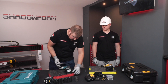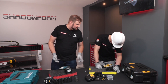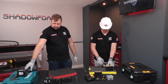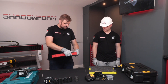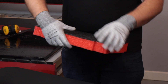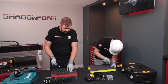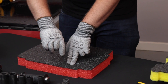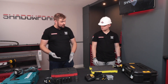I've gone all the way around mine now. Have you cut all the way around the profile? All the way around. And have you met back up at where you started? Brilliant. So now you take your drill off. And what you want to do is press on the foam to show the cut you've made, and go all the way around to make sure that cut goes all the way around the item. If someone hasn't cut all the way around, they'll start cutting as deep as they can, then they'll lose the line and start guessing. That's where mistakes are made.